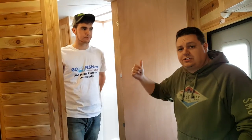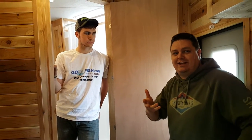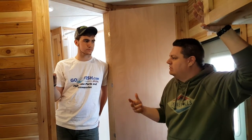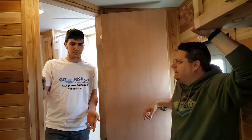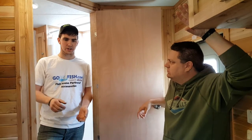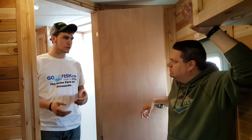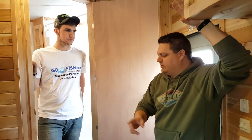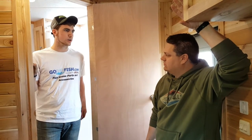Jake is our shop manager and he talks to a lot of different customers. What are the most common things people wonder about? Probably the most common is people call in the springtime, especially if they just got a new castle — it was winterized when they bought it. When you go camping that first weekend, hop in the shower and you're getting lukewarm, alternating cold and hot water. The culprit is the valves on the water heater. We want to open up the two valves closest to the tank and close the bypass — the one furthest away. Then you'll get nice hot water and can take a good shower.